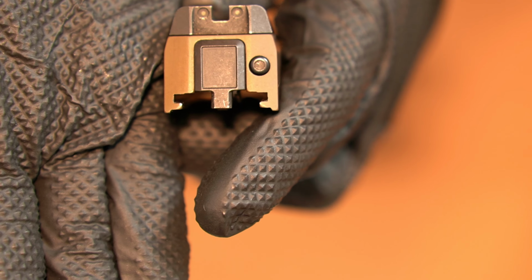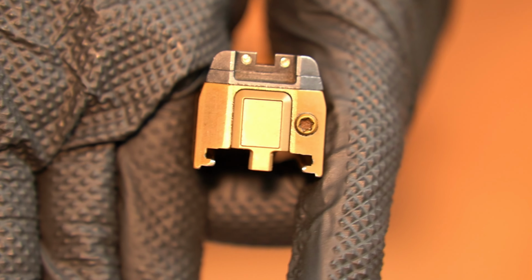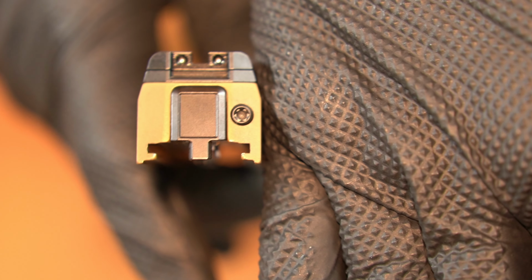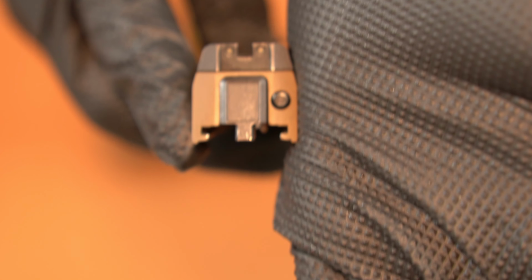There we go. Notice that it is just a plain dot versus the military versions, which have a T15 head machined into the extractor. Again, in the TC Overrun edition, also a T15 machined surface, as opposed to, once again, just the plain version on the commercial. There's no twisting involved. I don't know what the purpose of the T15 versus this is. Perhaps for more grip, because you basically just push that in order to get this slide plate off.